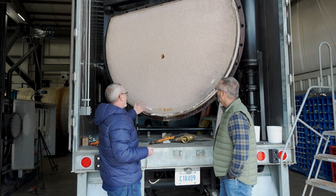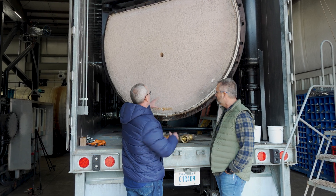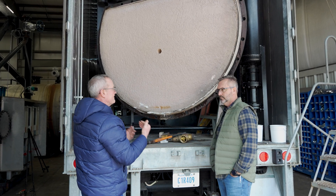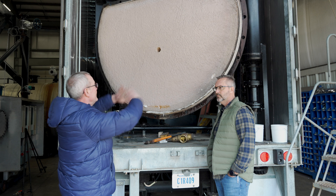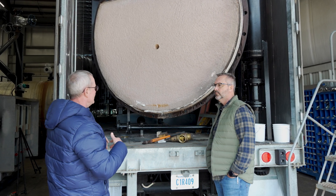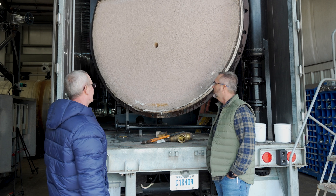What I've seen them do — they pour it, customer opens it up, and there's a piece this big around and this thick laying out on the floor. It just — you built steam behind it, it went boom, it just blew. You're not going to stop that steam, it's going somewhere. That water, when it turns to steam, it's going somewhere. They'll just blow it right out of the floor.